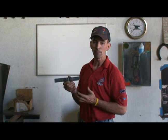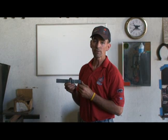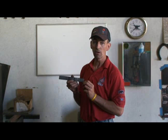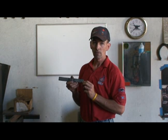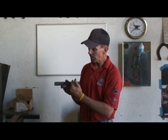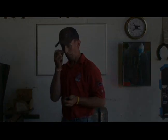I'm going to make an attempt. This is a really fast shoe. You have to move really rapidly because you have to build a pair of tongs with it. So the first heat I'm going to bump, and then the second heat I'm going to chisel in my knockdown marks. Alright, let's get to making it.